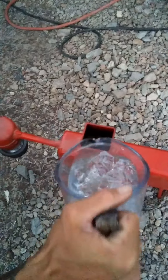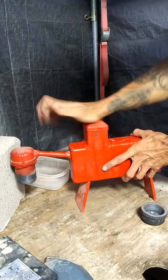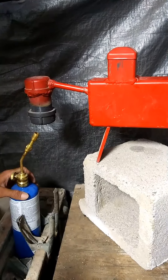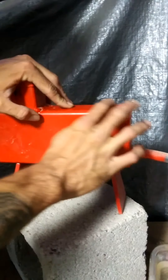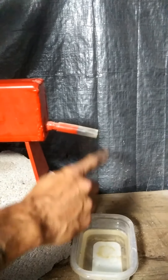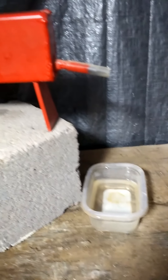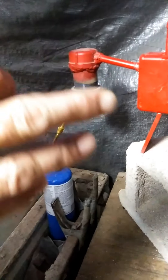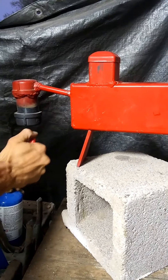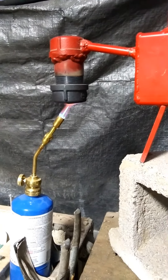So there's the ball right there. We're going to put it in what is called a retort system. That's going to distill the mercury and we're going to be able to catch the mercury and reuse it. We're going to add ice water to the cooling chamber of the retort system. Put the cap on. We're going to put a torch to it. The torch is going to heat up the amalgam ball, it's going to distill the mercury vapors. The vapors are going to condense at the other end and form back into the liquid state, and we're going to catch it in the pan.